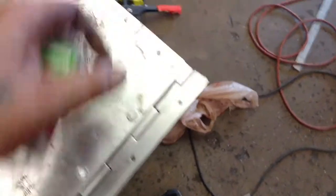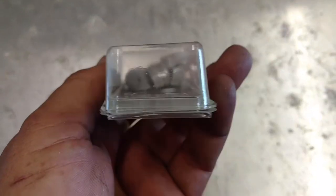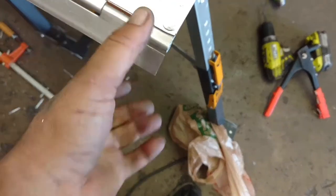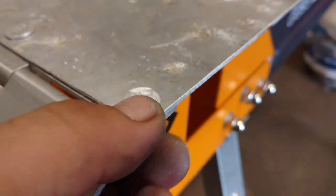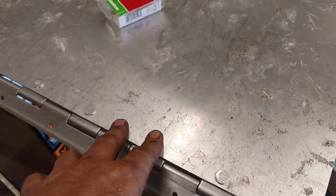I think they'll hold well. There's enough of them — 12 of them just on the door part. And then I got these backup plates — basically aluminum washers — and I put them on the back before riveting it together, which just gives it a little extra backing. Because those little nubs were sticking up, I grinded them down. That way there's not a whole lot of space to butt up against that square tubing.